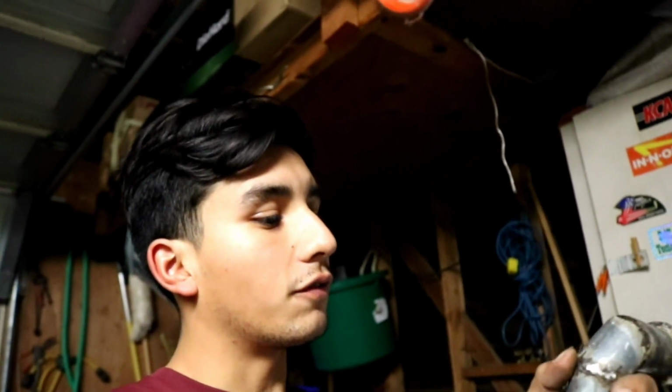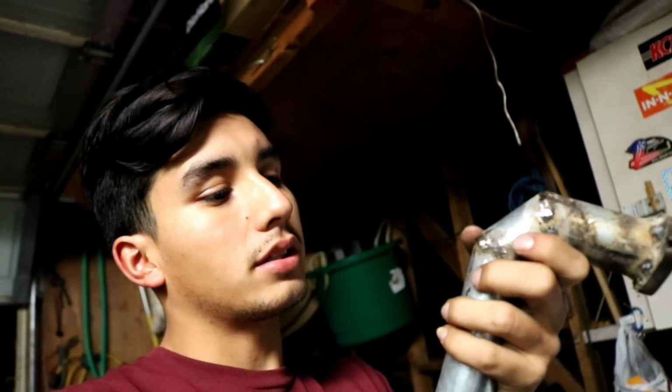I'm still not done. Alright guys, so this is the outro. I didn't realize I didn't have an outro for this video, so here I am, different day, different night, making an outro for this video. But right here with me, I have the screamer pipe. I really didn't do anything to it after the last clip you guys just saw, but pretty much all I gotta do is get a flap disc and flap all these nasty welds off, and it should be cherry. Because right now it doesn't look the best, obviously. My flap disc was really old and I used it all up, so I have to go buy a new one, and then I can just finish grinding all this away and she should be all solid.